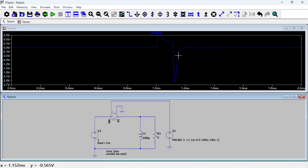So I think I'll stop here. Next time we're going to talk about what's called the pre-amp — basically how we're going to amplify this flyback decay so we can measure the difference between no-target decay and target decay, meaning the decay is modified and the voltage value here would be different. See you next time. Bye.